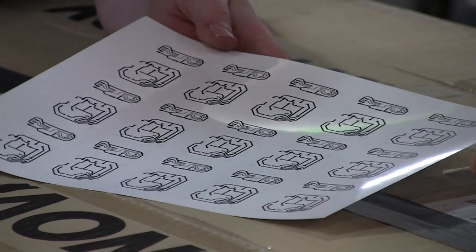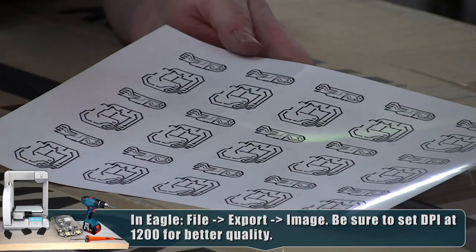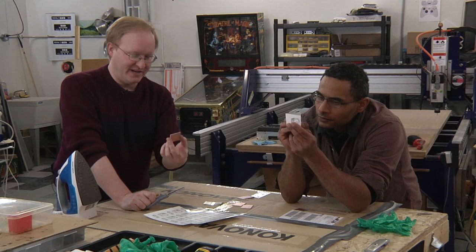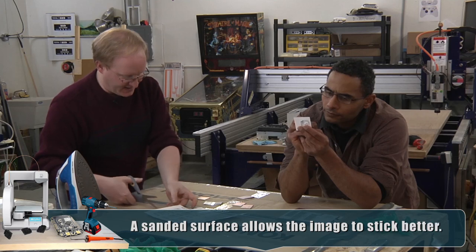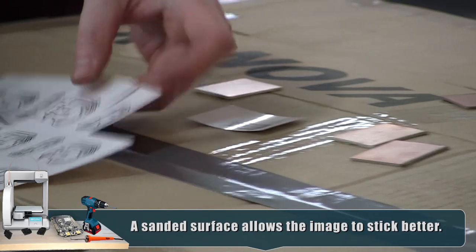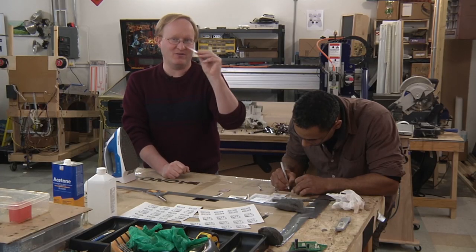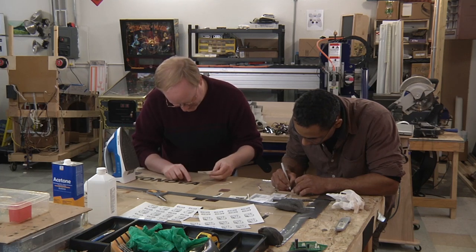I took this image from Eagle. I exported just the top layer since we're only making single-layer boards. I made it black and white and then printed it. I flipped it horizontally because when you transfer it, it obviously gets mirrored. I got some single-sided copper clad from Element 14 — it's already been roughed up, cleaned with alcohol — and cut it into approximately 40 millimeter squares. I'll try transferring this with the iron.